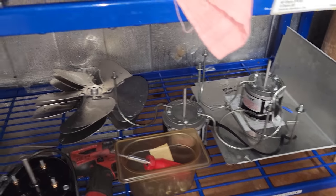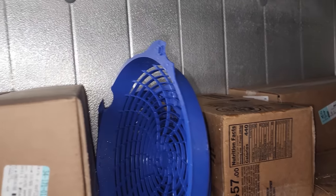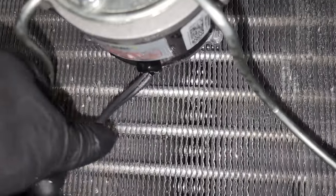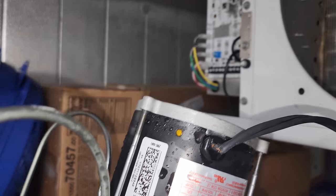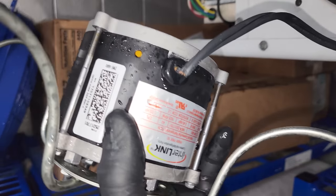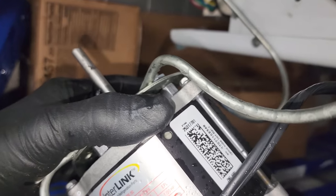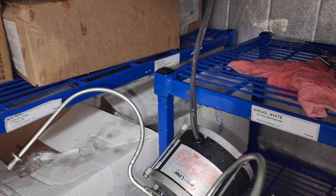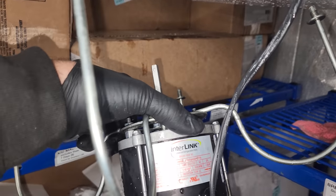I am back. I got three new blades, three new fan brackets, three new fan motors, and three new fan guards. As I'm pulling this motor out, I realized why it was making the buzzing sound because it's broken right here too — it's icing up and ripping those connections off. It's crazy the power of ice. I really appreciate how they have the part numbers on here. I went to all my suppliers' websites — I have active user logins for all of them — and I'm able to see which supply house has all the parts instead of making phone calls and waiting.